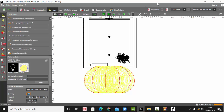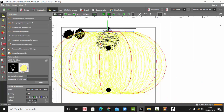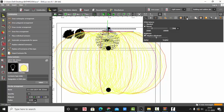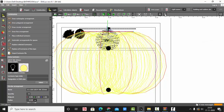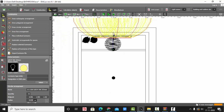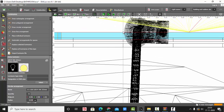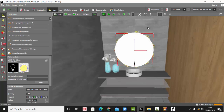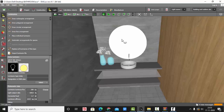Go to the plan view. As you'll see, the luminaires have been placed outside — bring them inside. This is the light output and how the light will be distributed. If you are unable to see it, go to Results, go to the small Display Options, and find Show Light Distribution Curves — click there and you will be able to see it. Once the curves are visible, select the Rotate option and rotate it. By rotating, we want the light to hit the wall, and once it reflects we will have a nice cove light effect. Place the lights properly — here are our lights properly placed.